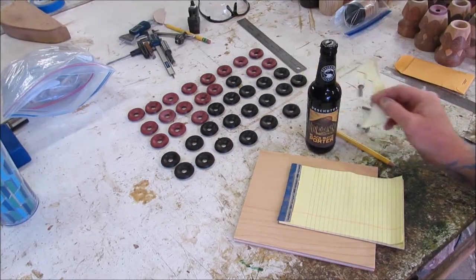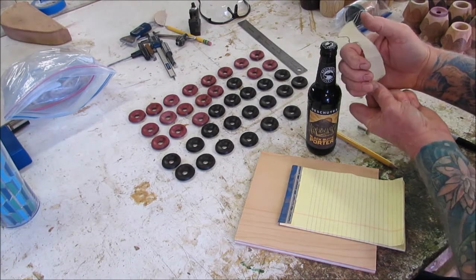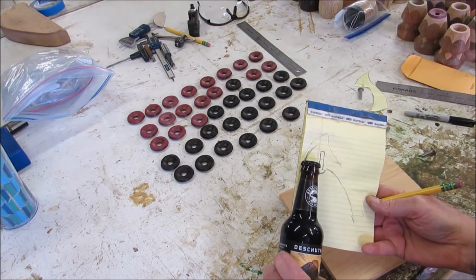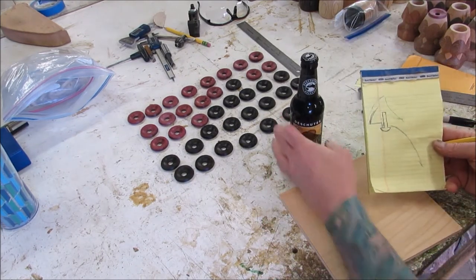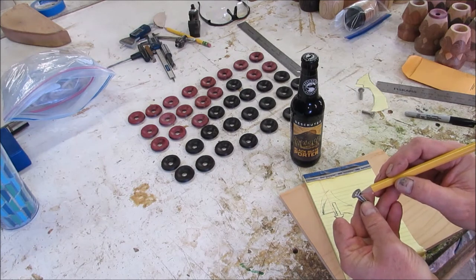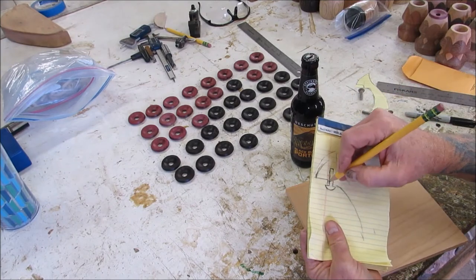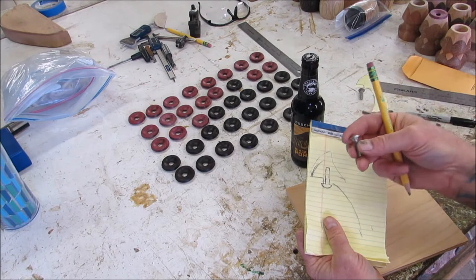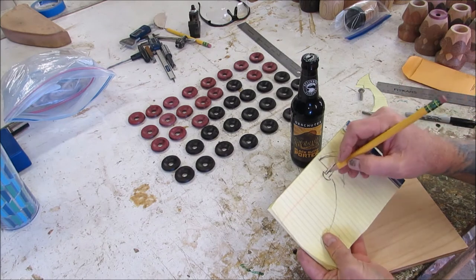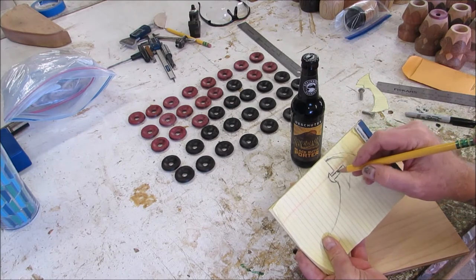It was a good idea to go get a model for this project. I can see right away this ain't gonna work — I got to crank this out substantially to achieve that. Now I got my model here, I can see how I want that to work. Originally I was going to crank this bolt in and use a small box-end wrench as a way to crank it into a threaded hole, but that makes it look crappy right here where that thing is sticking out. So I think I'm just going to turn this square shank off — it allows me to make this really clean right here — and the wood is going to come out right back there like that.